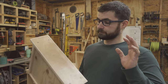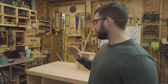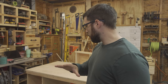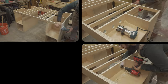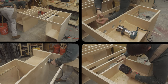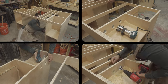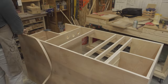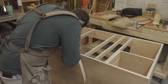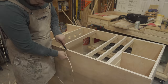On the plus side, the polycrylic on the drawer faces looks fantastic, so that's going to be my way forward. My first task is to give everything a once-over sanding and then start applying edge banding to the top. I applied edge banding using a normal clothes iron, making sure to go slowly to allow the adhesive to fully melt, and then letting it cool for a couple of minutes before trimming it with a razor blade.